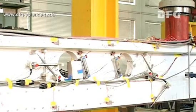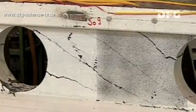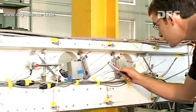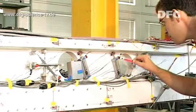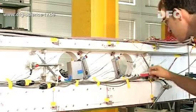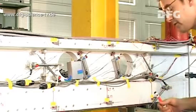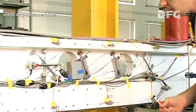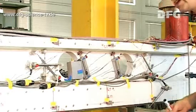At a shear force of about 25 tons, one of the vertical reinforcement bars cracks — a clear indication of shear failure for the researchers. This crack here has expanded considerably, indicating that the fibers have been pulled out of the concrete and that this bar has failed. There is also a place where the concrete has spalled off — localized failure caused by excessive deformation in this area. The load has dropped back to about 75 to 80 percent, and now they relieve the load completely.